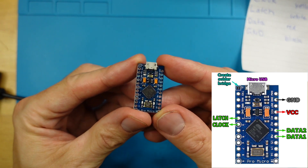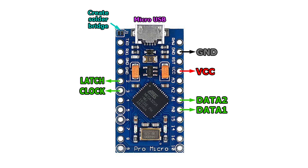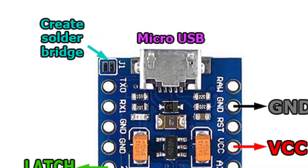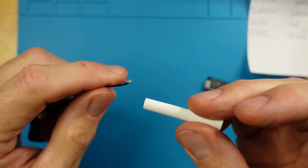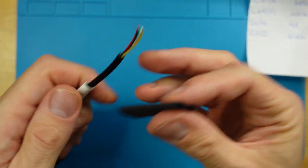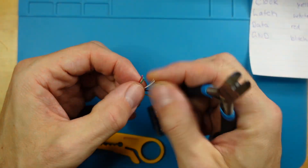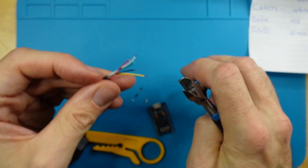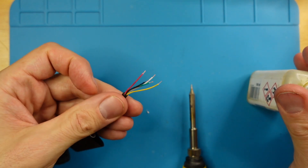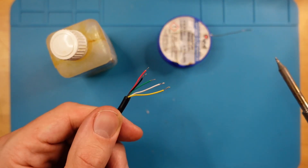It's pretty straight up and down — it's about as easy as soldering's ever gonna get. You already have the diagrams, you know exactly which wire to put into which pole. We're gonna have to do a little solder bridge at the top — it's not mandatory, but it's recommended by Mick. Before we go on, let's take our heat shrink tubing — it needs to go on right now over the top. Just for the sake of completeness, I'm gonna pre-tin the ends of these wires so they solder in a little bit easier.